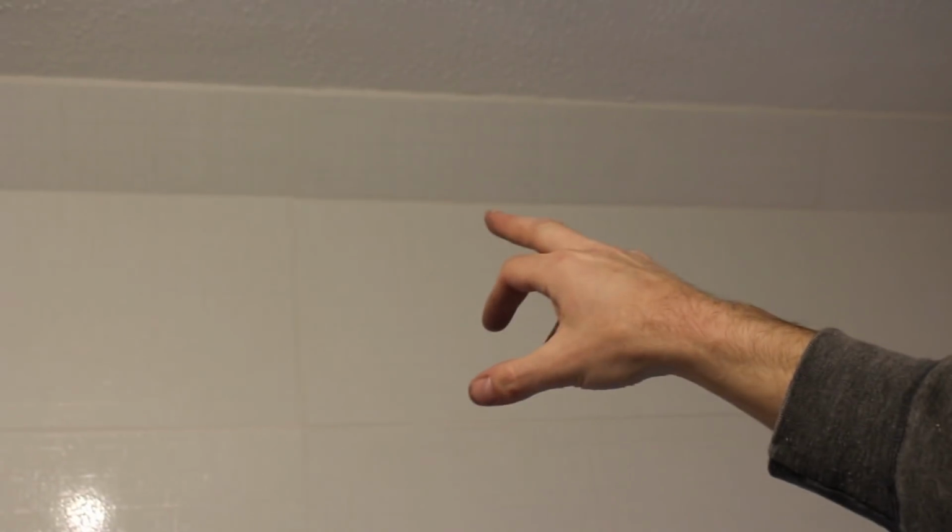The tiles at the top, there's an interesting little angle, but again, as long as you space the tiles correctly, which we have done here, as you can see at the very top, this is all tile adhesive along here. I can use silicone, but I use tile adhesive. We'll see how it goes. If it cracks and falls out, I can always put silicone in. But certainly all the lines need to be exactly where they are.